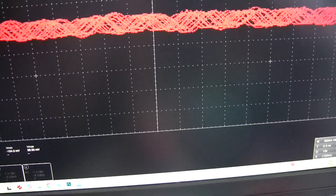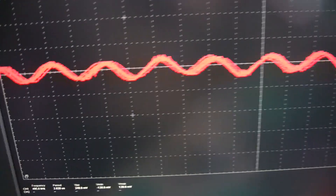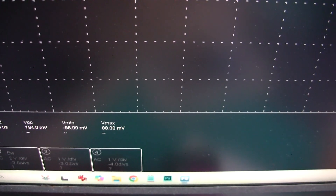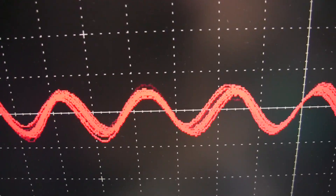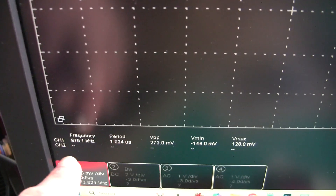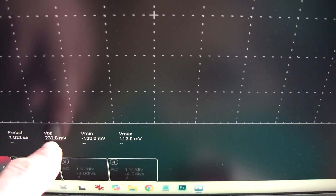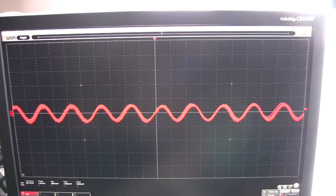If I remove the trigger there is a big mess, so I put the trigger back on the oscilloscope. We settle on 170 millivolts peak-to-peak. So we have 1.5 volts peak-to-peak from the signal generator — if I increase it we get a better, nicer signal. That's quite a nice signal right now, and clearly it's settling on the frequency much better. We have 240 to 270 millivolts peak-to-peak, fluctuating, and about 120 millivolts peak — that's how the output from my probe looks.